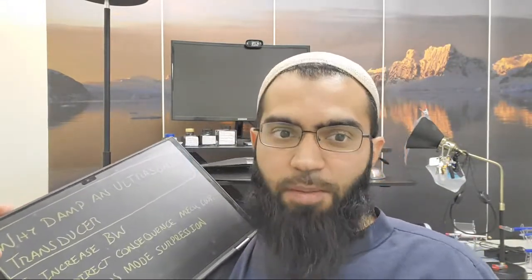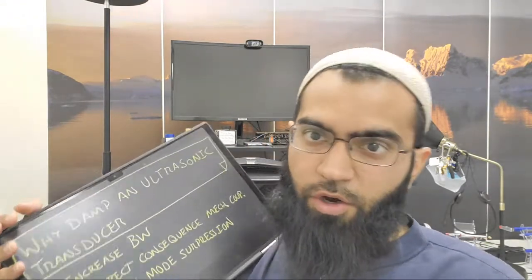So you could redesign your electrodes, or what you could do is just, let's say you put some epoxy on that electrode to damp it out, to damp out that resonant mode. So now you've actually damped, well, not the main mode too much, but you actually have damped out the resonant mode of that electrode occurring.